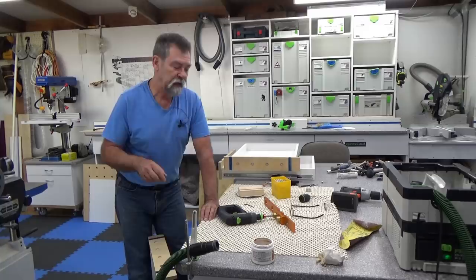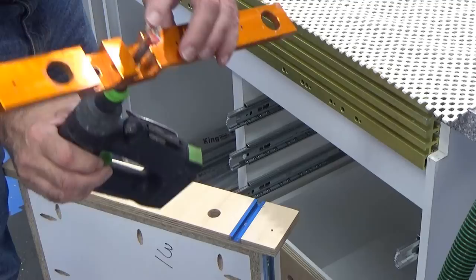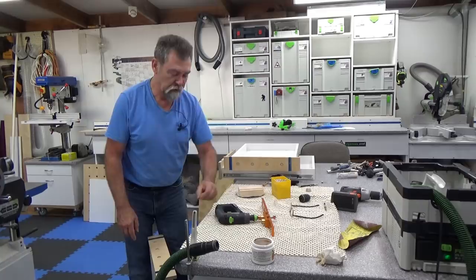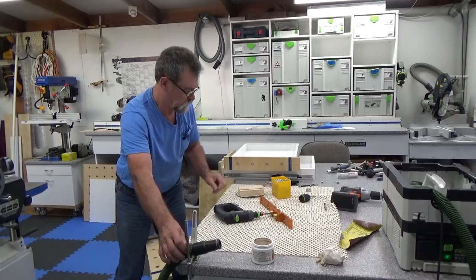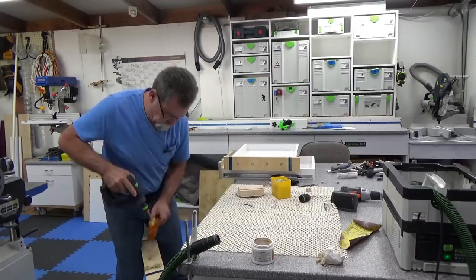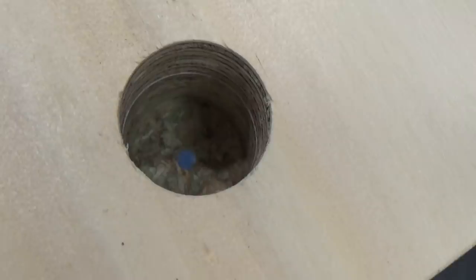So as I go down, the cutter cuts a little disc at the end and it starts to spin and it can't cut through it. These side cutters here underneath can't pick it up. So it will spin and the drill can't go any further. So I use a small Allen key that came with the drill that puts the collar on. I free that little disc up and suck it out with a vacuum cleaner, then I can keep going down. You might notice down in that hole, I have not gone all the way through.